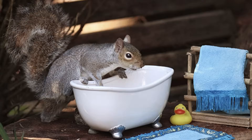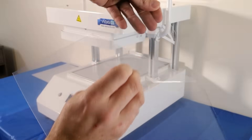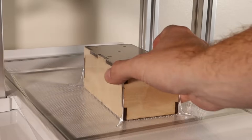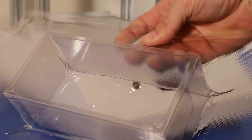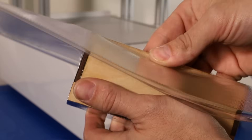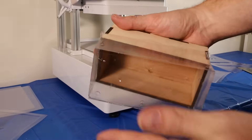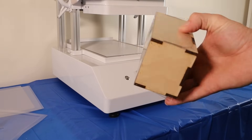It looks kind of like a bathtub for squirrels. You can get different thickness plastic — I am using a plastic that is 0.5 millimeters thickness. It's transparent PETG. This time I'm going to do the box upside down. With this technique, it's like a single walled box; before, it was a double walled box like a tub. So I don't think we're going to run into thin spots on this one. Wow! I essentially just made a lid for this box — a transparent lid. The opportunities with a machine like this really just come down to me figuring out what is possible with it.